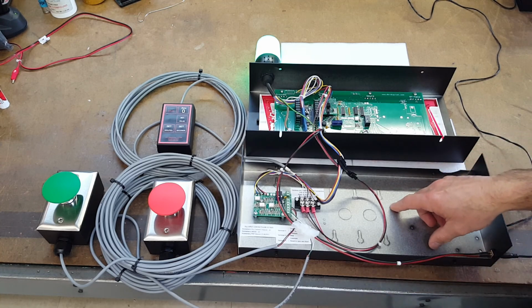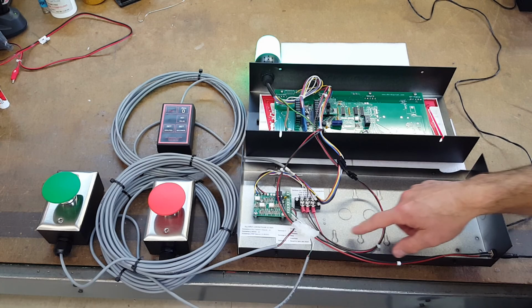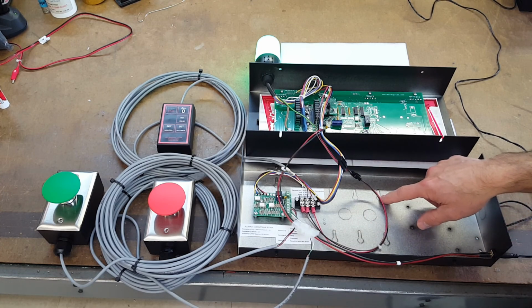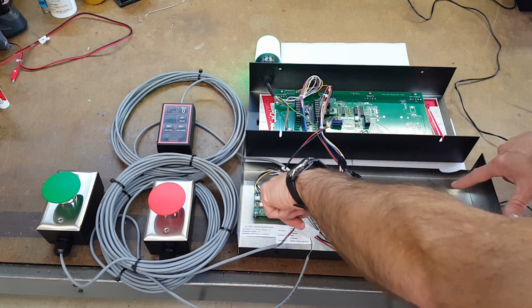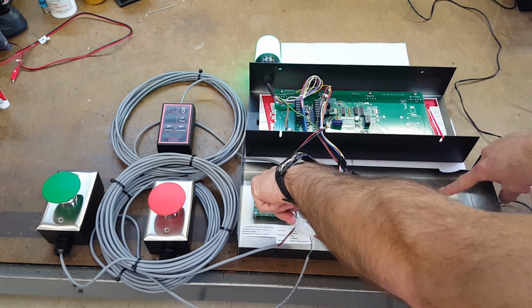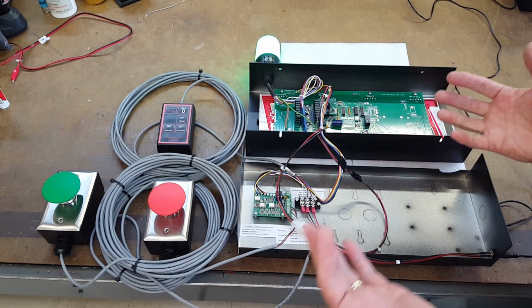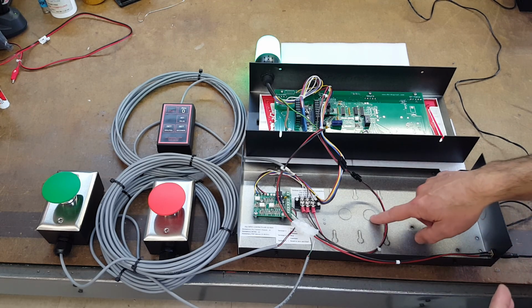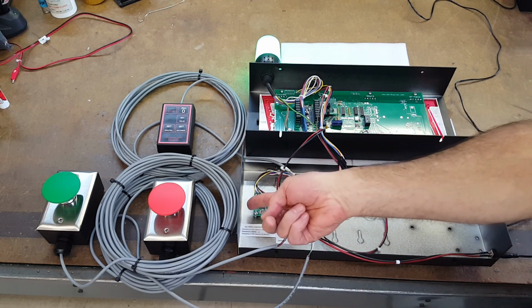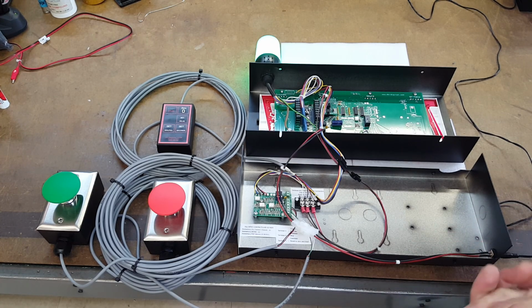Also, as you can see, the rear part of the enclosure has these teardrop mounting tabs. This is for a 4-square or a handy box electrical. Then we also have 2 teardrop mounting tabs if you don't want to go with an electrical handy box or electrical box. Also the access holes are knockouts. There's 4 of them, 1 on either side and then 2 in the middle. Those are for 1/2-inch knockouts.